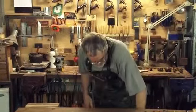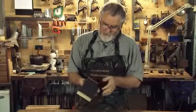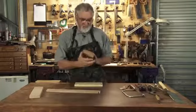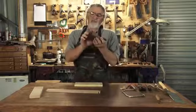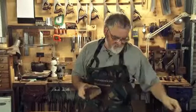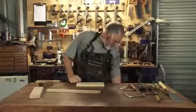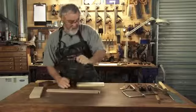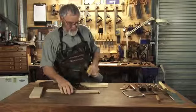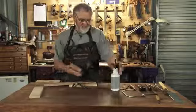And again, there are several ways of doing this. I've made a little block, it's just a piece of wood, with some 80 grit sandpaper on the back. I've got another straight edge, which I've had for years. Just a block of timber, but make sure it's 90 degrees from the base to the face. The top's a bit manky in the back, doesn't matter, but you've got to be mindful of dressing it. And I use a bench hook. If you don't have a bench hook, an ordinary F-clamp will do. Again, squirt of water. It's amazing how much water grips.